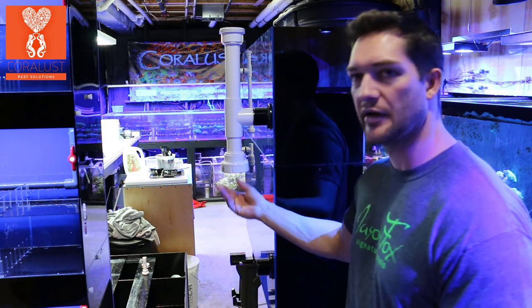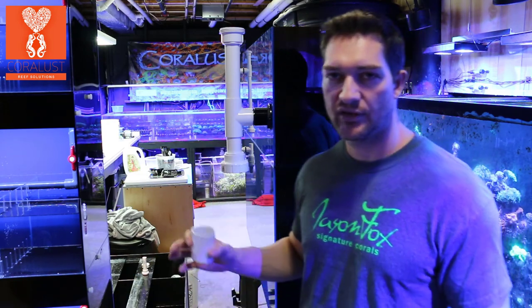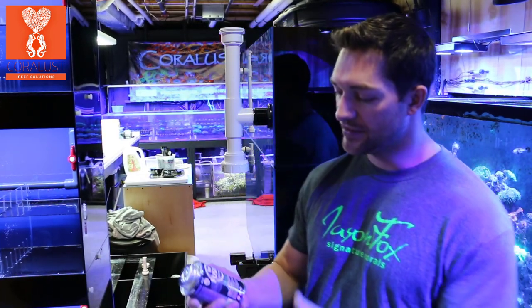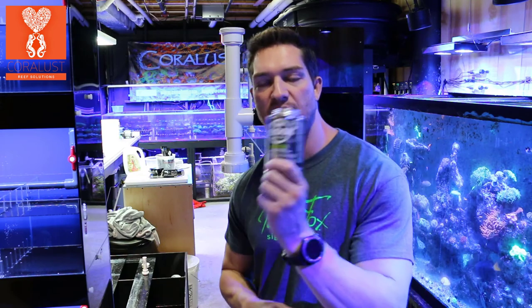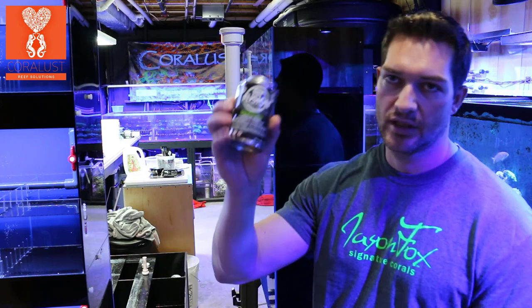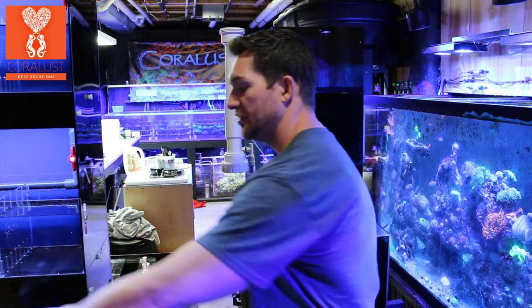Now this has to be cut off — the pipe's going to be shortened, I have to put in another sleeve so I can extend it and make sure it's okay. Also, some of you go out and get your purple primer and all that good stuff. This is an all-in-one, it's clear, so you don't have to mess with that ugly purple color that gets all over your pipes. This is some new PVC cement that I picked up and I'll be trying that as well.